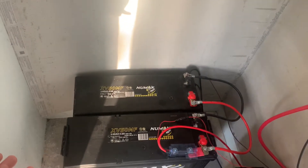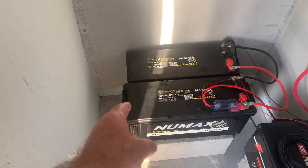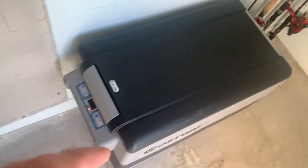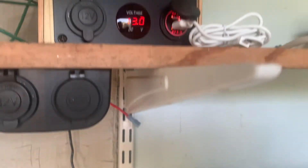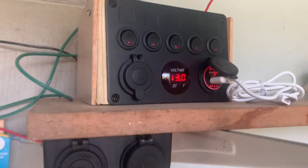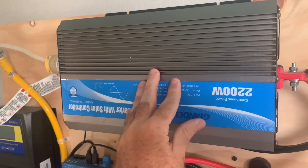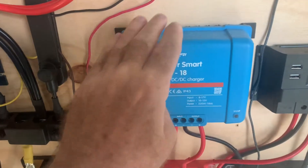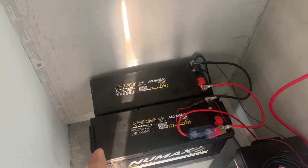You could do this too, if you wanted to have a second battery bank and dedicate it just to 12 volt. So what I'm doing with these batteries here is running my 12 volt fridge, along with just a little switch of lights and accessories in here. I recharge some things for in the house, anything USB can be plugged in here. These minor loads do not interfere with or take away from my ability to invert and have power running to where I need it. This is a way to isolate the two functions — 110 coming off the big battery, and 12 volt stuff coming off the older batteries.